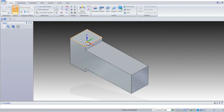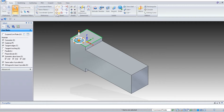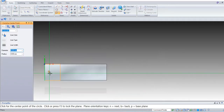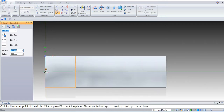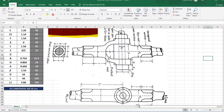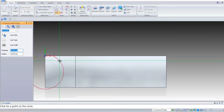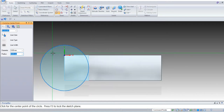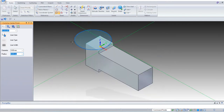Select this top face. From this exact center point, draw one circle. The diameter is capital D — capital D is 60 mm. Enter 60 mm. Right click or escape. Now select Ctrl+I — Ctrl+I is the isometric view shortcut.